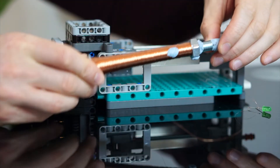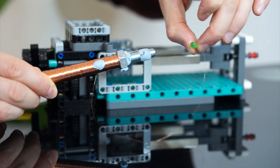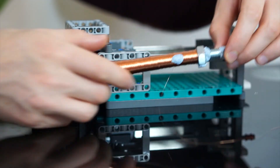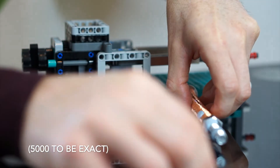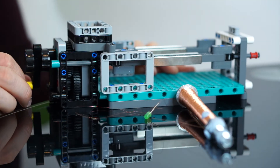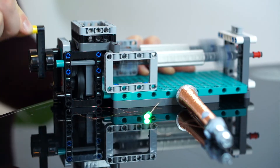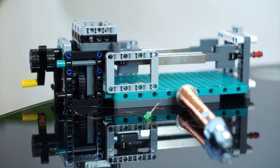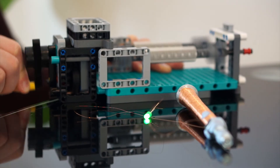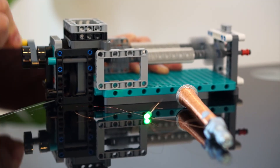There's also a fun little experiment I wanted to try out — not very practical, but I just wanted to build something that could pick up some magnetic fields from quite a distance. So I wrapped an entire 100g roll of 38 gauge wire, which is very very thin, around a large iron bolt — probably a few thousand feet of wire on this thing. This thing is quite sensitive to magnetic fields from a distance and can generate quite a large voltage when up close, though there is a huge resistance due to the thin wire and the ridiculous length. Here you can see I've placed the bolt near the spinning magnets, and it seems to light up quite brightly. As I move the magnets away, the LED dims. In some other tests I've actually managed to light this up from over a foot away using stronger magnets.